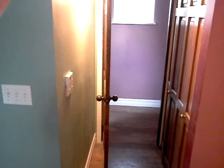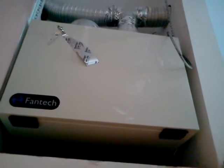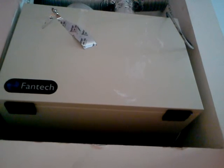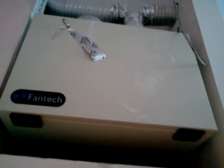And additionally, in addition to just giving you fresh air, the aluminum core heat exchange in the HRV allows the heat that is inside your house, that you've already spent all this money or energy to heat up, to transfer into the cool, unconditioned air from the outside. So in the winter, let's say it's 48 degrees outside and 70 degrees inside. 60 in this case, with this model, which is a relatively inexpensive model, it costs about $800, I guess. 68% of the energy is transferred from the coils that are passing through the interior of this mechanism into the incoming air from the outside.